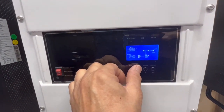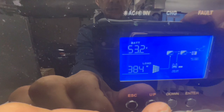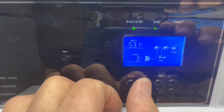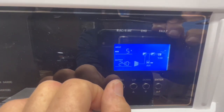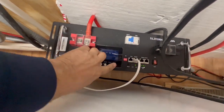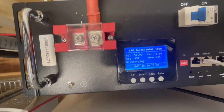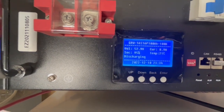Let's see if this kicked back on — yeah, we're going at 360 watts, 384, 400, so it kicked back on and it's going up. We're using around 3 amps out of our battery and we have 5 amps coming in, so we've got a little bit coming in. On this battery we are at a 95% state of charge, and it says about 8 to 9 amps that we're draining as we're running that. So it'll take a long time to drain that battery.